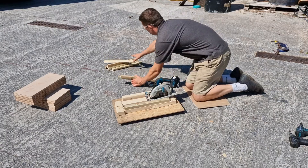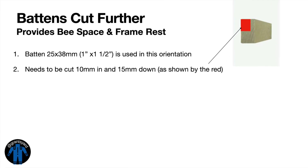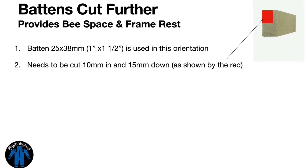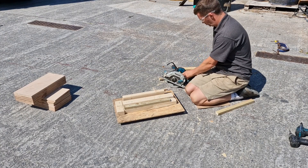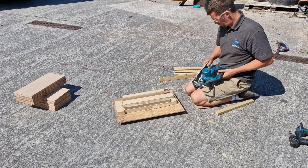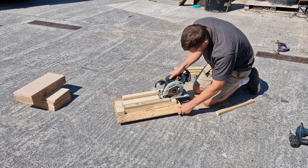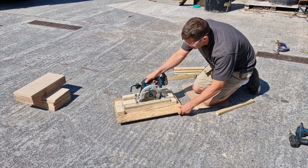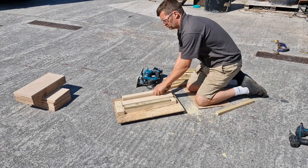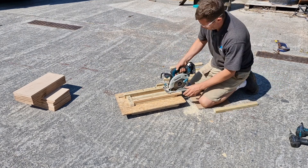The first thing we're going to do is cut the top bar, which is the part where the frames are going to sit on. This piece is a 25mm by 38mm section and it's going to have a 10mm by 15mm section cut out of it as shown on the cutting plans. For this I use a jig, which makes it a lot easier and quicker. I set the depth on the circular saw and cut maybe 10 or 20 in a row, then change the depth and switch the jig for the second cut. You can also use a router, hand saw, or chisel - all work just as well.